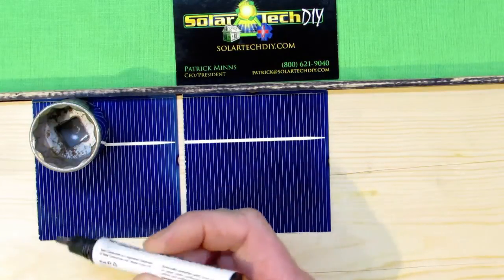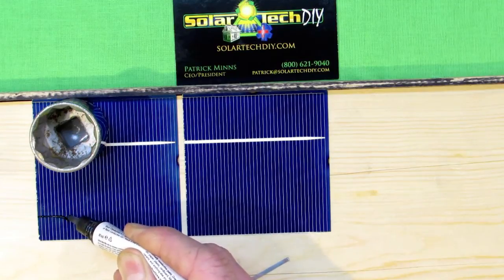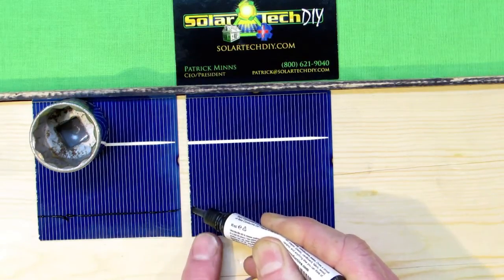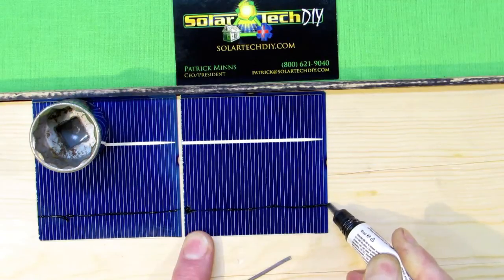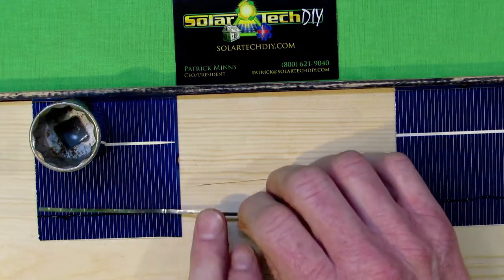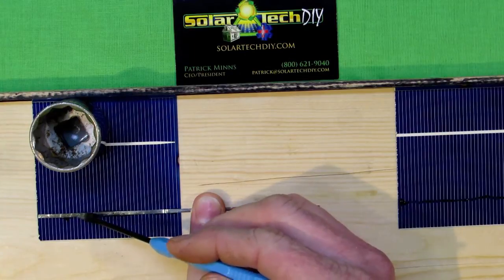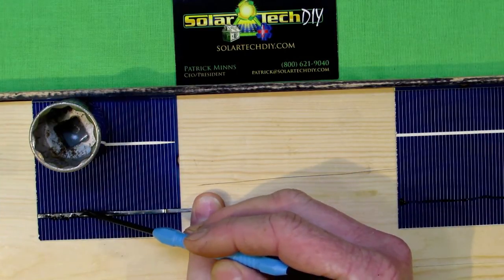To illustrate the principle of how these solar cells are manufactured: when you look at a solar cell, you're really looking at two separate processes. The polycrystalline wafers are cut from a solid ingot, which is a crystal synthetically grown out of silicon. After the wafer has been cut from the ingot, it is further processed — including etching in the wires that run perpendicular to the tabbing wire.